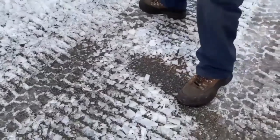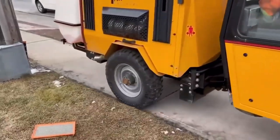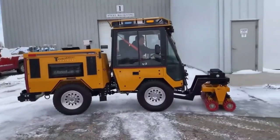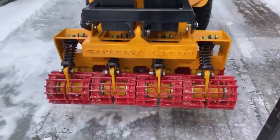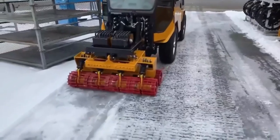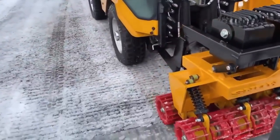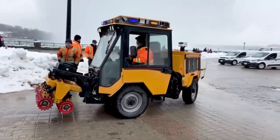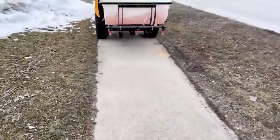Snow Lion's icebreaker is an effective way to keep roads clean and tidy without using harmful chemicals or salt. This in turn makes it possible to repair roads less often. The manufacturer offers four models for different situations. One is more suitable for hard ice and severe frost, another for soft ice, the third one for ice covered with a layer of snow. The number of spikes, respectively, varies from 18 to 120. The working width depends on the number of rollers used. Their width is 43.5 centimeters.